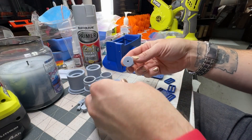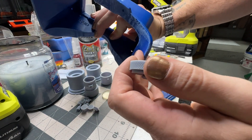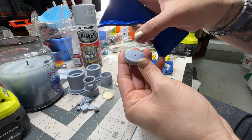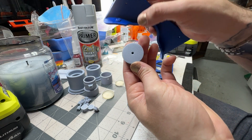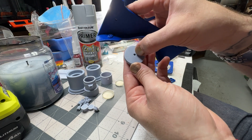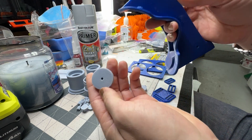I'll do that for those two. For the others, you've got a little more leeway because you can get to the inside of the frame. You could just put a short screw in there. Sometimes I'll buy socket heads and cut off the excess so you can thread it right in there. I use a tap and just tap into it to give the threads it needs, so you can screw it on and take it off if need be.